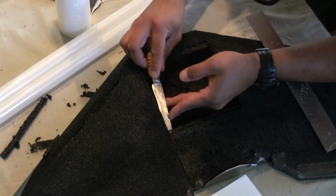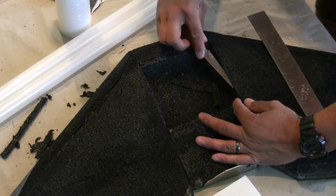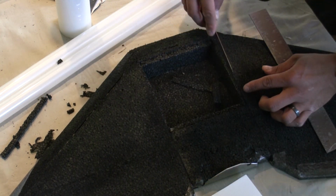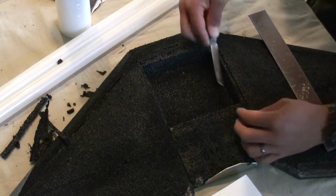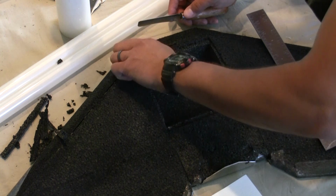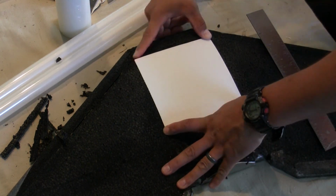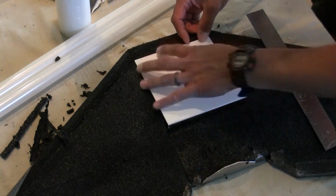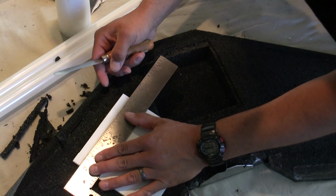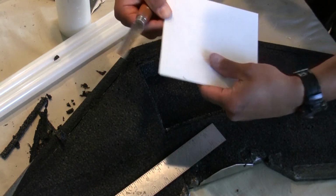It's not 4 millimeter coroplast. I think it's like 2 or 3 for the lid, so it doesn't need to be that thick. And usually cut about 1/4 inch or so, 3/8 or so for the front, and about the back, just so your Gorilla Glue can fasten the front of the battery bay lid to the EPP foam. So it works pretty good, and it's pretty strong.